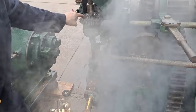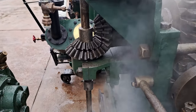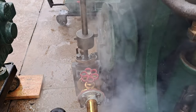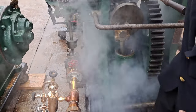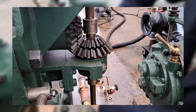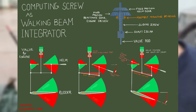The way you offset it - when I turn the small wheel, I turn the screw inside the screw collar, and you'll see I make the valve move up and down. The valve rod doesn't rotate - only the screw does. When I turn the screw and move the valve one way or the other, the engine will want to run. But when the engine runs, it turns the screw collar back the other direction, moving the valve back to center. So the engine always seeks to find the center, and when the valve reaches center, the engine stops because the steam flow is shut off. That's the computer that operates the steering engine.